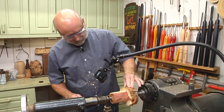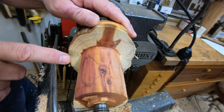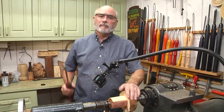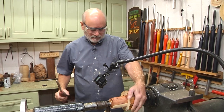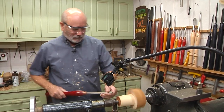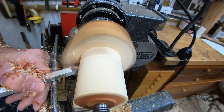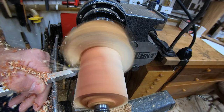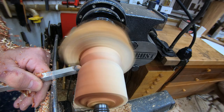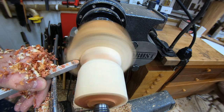We're starting to get our shape, and this is cool. I want to leave this natural edge all the way around — I think that's going to be the neatest thing. There's that cool cedar color. I just want to scoop this out. I want this to be able to stand on its own. We have the air cleaner blowing like crazy because it is dusty. Let's start shaping this — I'm going to use a round carbide cutter to help me get the swoops. You could use a spindle gouge or a bowl gouge at this point.